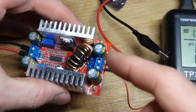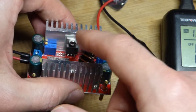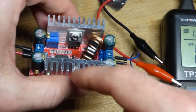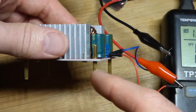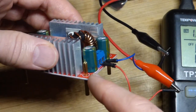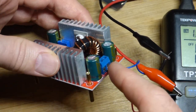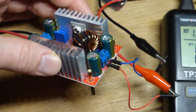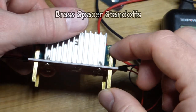This is safe to touch when not powered, and probably safe to touch the heat fins even when powered — usually the fins are attached to one of the pins, probably the ground pin. I think those components are MOSFETs, so these fins might get electrified — I'm not going to touch this while it's being powered. Also, the capacitors store charge, so be aware of that. Hopefully they discharge when you turn the power off.